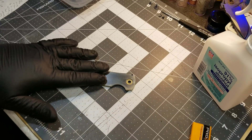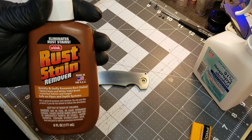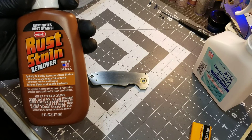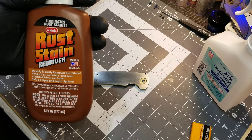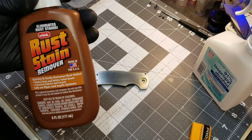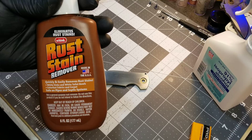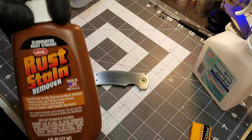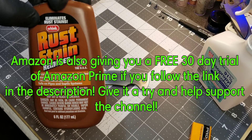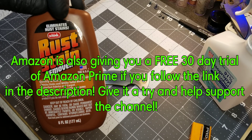I always wear gloves so I don't leave any more marks on there. Now that the piece is ready to go, if you plan on keeping your anodizing, I do recommend etching with the Wink prior to anodizing. Just a quick 10 seconds in the Wink and you're good to go. Just be careful — it's a very diluted hydrofluoric acid, around 3%, but it is still hydrofluoric acid. Make sure you wear gloves, eye protection, all the proper PPE. If you're interested in picking up some Wink, I've linked an Amazon link in the description — it doesn't cost you anything extra but helps support the channel.